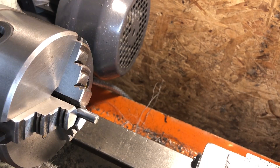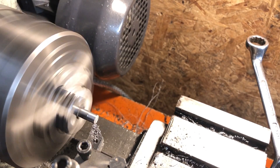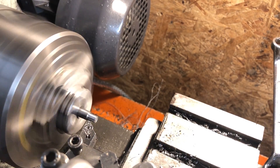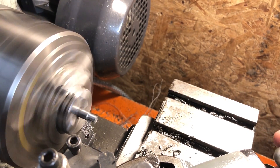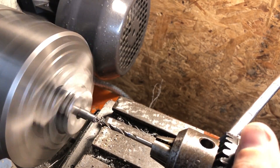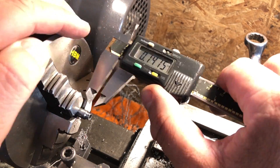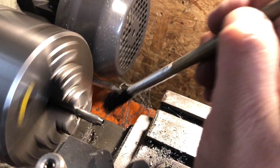Next up is the clamp which is designed in three parts: a nut, the clamp piece itself, and finally a screw. I'm going to start with the nut which is a simple turning job to be a press fit into the 4.7mm hole in the sector finger. We can then swing the top slide over to cut a 45 degree chamfer to locate in a countersink which will be cut into that same hole. The nut is then drilled and tapped M4 and reduced to final length before a chamfer and countersink finishes this side.